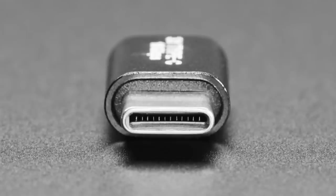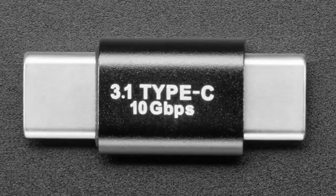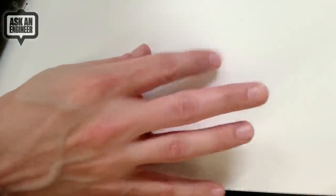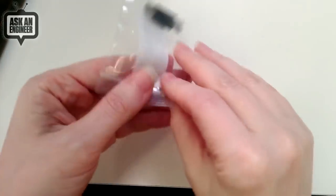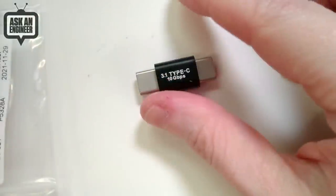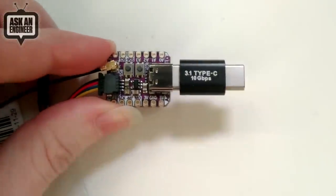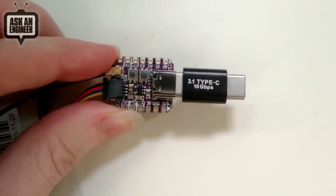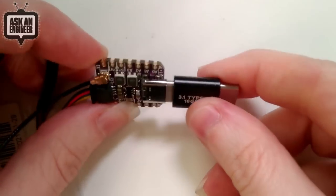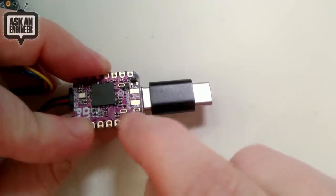Next up, we've got this dual-head USB-C connector. Basically, you've got a QT Py and you want to turn it into a Trinket — this will do the job. Let me grab one and show it overhead. Here it is — and then this plugs in right here. My generation was ruined by Requiem for a Dream. You plug it in and now you can plug it into your laptop and make a little dongle. People ask why we don't make the QT Py with a USB-C that plugs directly in, but that's a mechanical nightmare. This is actually much better because you get the strength of the half-through-hole design — the pads on the side of the USB-C go through the PCB.